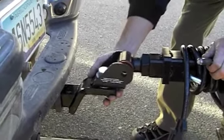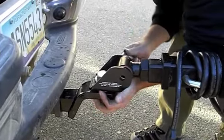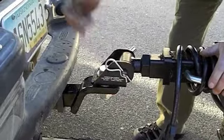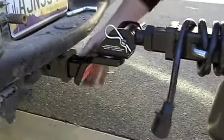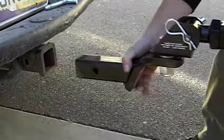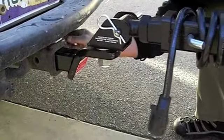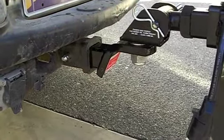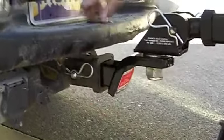Remember your receiver is a little loose, so not necessary to pull that up and down all the time. Just get this lined up, line up the hole, and pin goes in — and don't forget your safety cotter. There's another way of putting the pin in: keep it attached to the receiver or the draw bar, then line the receiver and draw bar up, slide the pin in, and put the safety cotter back in.